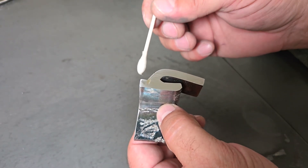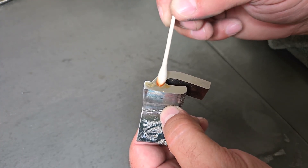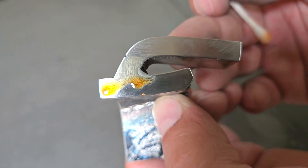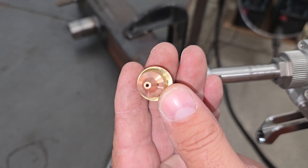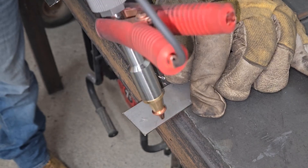I'm not sure I would trust it for welding structural plates supporting large dynamic loads on heavy equipment or something critical like that without more thorough testing, but I'm pretty sure this machine's limits are a little underrated in the right hands. Satisfied with its welding performance, I moved on to set up the torch and machine for cutting 1mm thick steel. For this, I switched over to using compressed air at 60 psi.